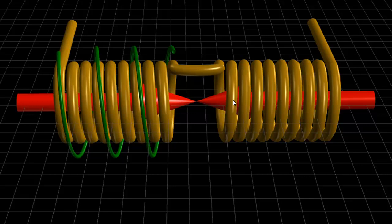It's a delta T, which is the change in time of magnetic fields. We've got three magnetic fields in total: one magnetic field associated with this coil, one associated with this partnered output coil, and another associated with the green input coil here. Remember our equation. Our green input coil might give us a magnetic field that faces this way, opposite to this red arrow here. By Faraday's law of induction, this partnered output coil starts generating an EMF, a voltage. The current will oppose, so the red arrow faces this way.